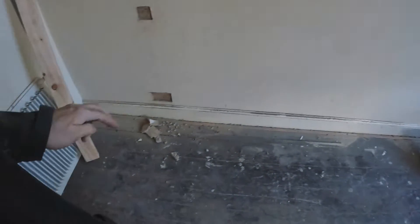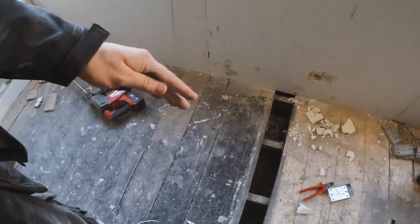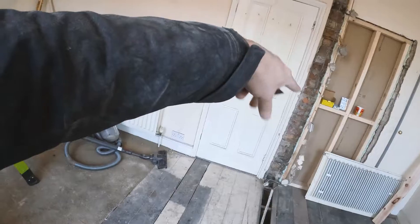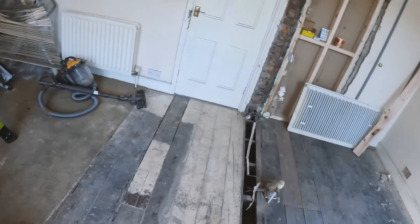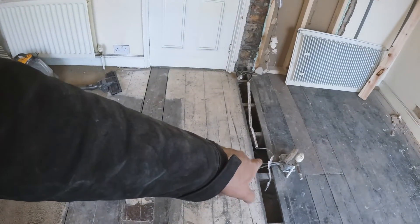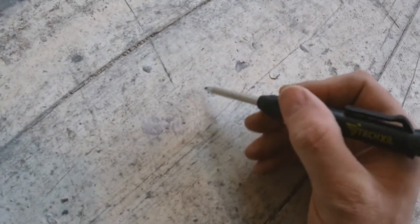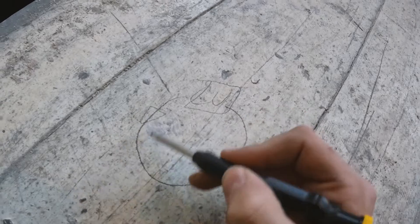That's them chased out. What we're going to do is get a floorboard up underneath each socket and each switch to get a route. The floorboards run this way, so all we have to do is get one up, fish this way, drill through, and get cables from the switch position. For the sockets, we've just got to extend the ring — there's a socket here which is part of the ring with two cables coming in. So the way the sockets work: you've got a consumer unit that comes out to loads of sockets on a ring.